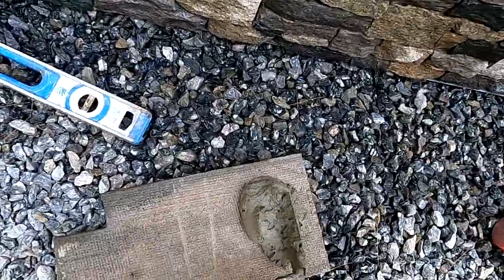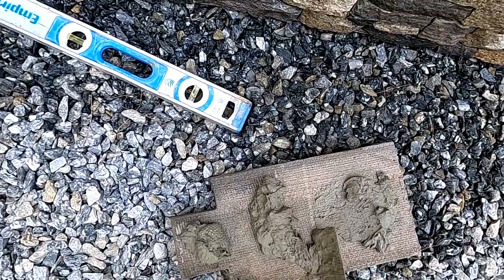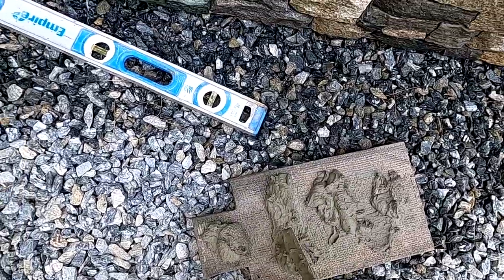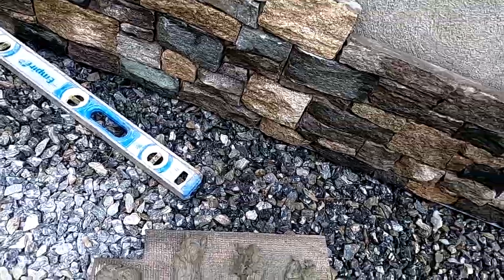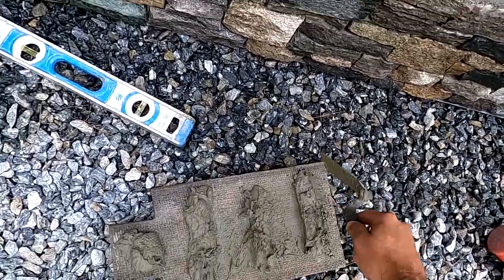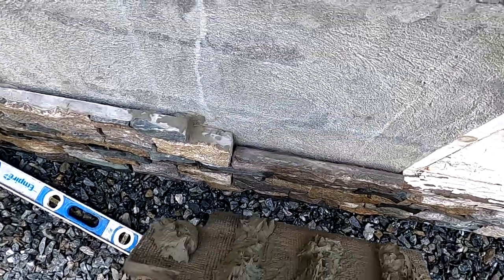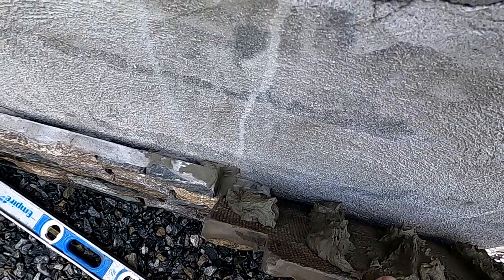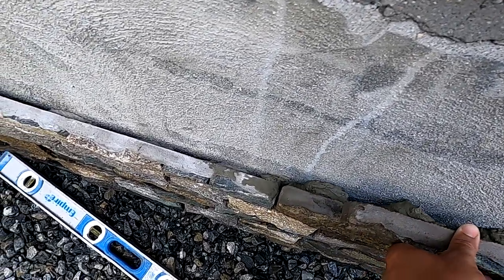It's a cut piece, but it's pretty much the same thing. I'm going to put a little dab on the interlocking tab right there, make sure that that has a good bond, and I'm going to set up just three rows of equal and even strips of the mortar. And what that's going to do is let me set the panel onto the wall at the correct depth. Some are thinner and some are thicker than others. So these thick beads of mortar give you some room for error and can allow you to stop the veneer at the correct depth to ensure a nice plumb face of the stone veneer.